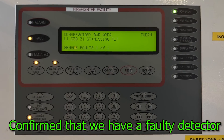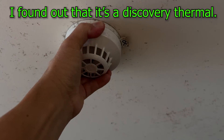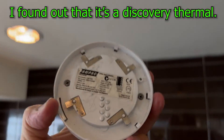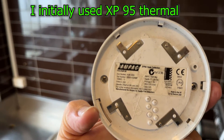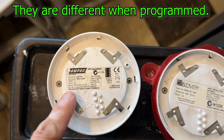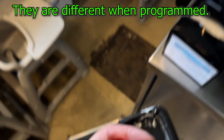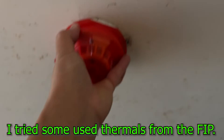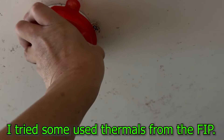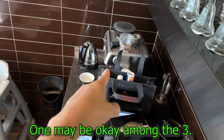The missing fault still exists after reinstalling. Now, this is an XP95 thermal detector — big difference from the Discovery. That one is a Discovery, that one is an XP95. We're going to install the Discovery one here. Why install a Discovery detector here? Because there's a copy machine here that produces steam.